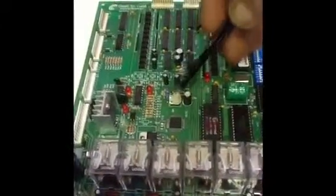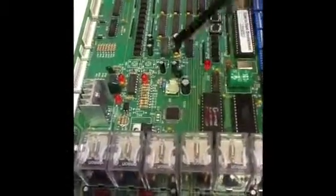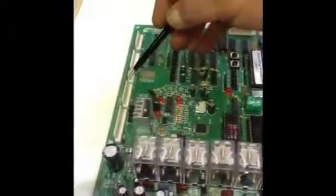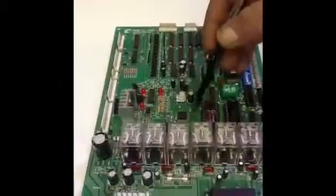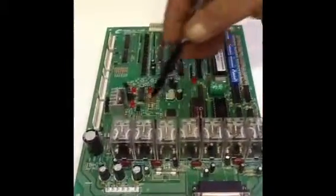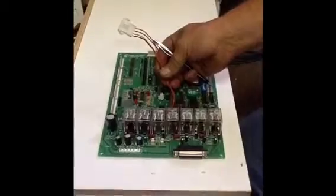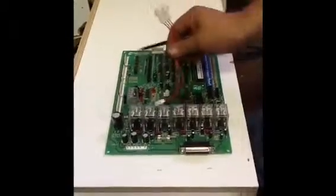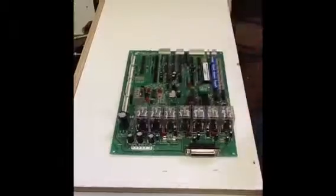Dead center on the board is your pot — a potentiometer — and that's for your volume control. It's the only one on the whole board and it's always on the board in all of our machines. On the earlier versions of this board, this four-pin connector used to be in the middle, and either you had three pots representing the three claw stages, or you had four wires — a neutral and three wires — going to a connector plug. We went from a board with three pots, to a board with the connector in the center, to this board where the connector comes off on the side. That's the only difference in all of our boards; otherwise they're all the same.